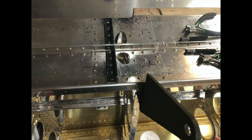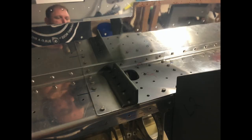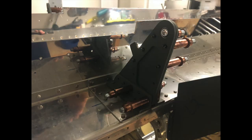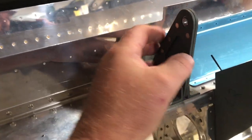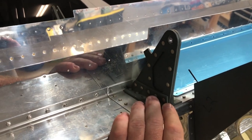I'll put some pictures up. It was hard to get these rivets out — it took about two hours because I really didn't want to damage the trailing spar or any of the doublers. I was really careful about drilling, and then I tried cutting the heads and pounding them through. I finally got it, but it was a little more work than I wanted. I had to do it right.